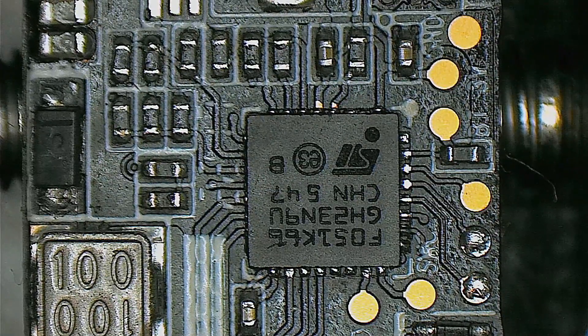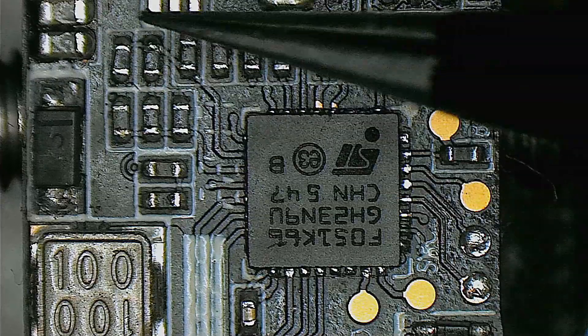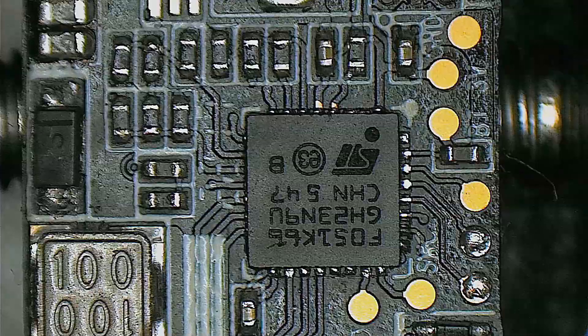And now let's power it up and see if we have the normal current draw for this ESC. Oh my god — this MCU had BL-Heli with a startup song and we see exactly 30 mA of current draw. So that's a good sign. The MCU was the culprit and I suspect it was something related to the breakage happening here. All that's left to do is just flash it with the correct version of BL-Heli, obviously the newest one. But this one is fixed. Thank you very much guys for watching, and till the next time, bye.